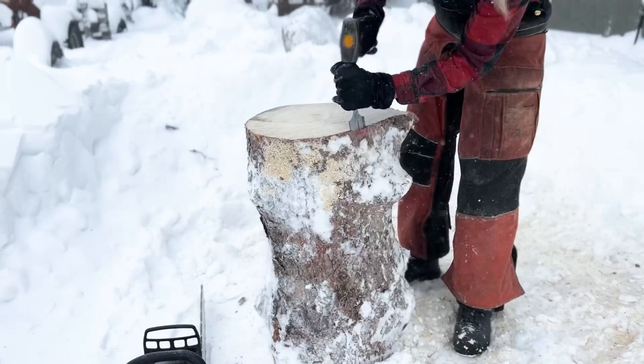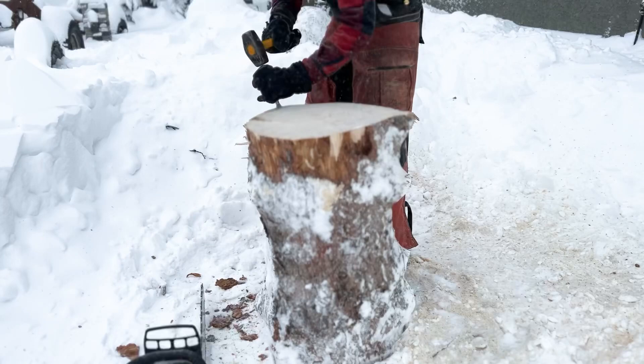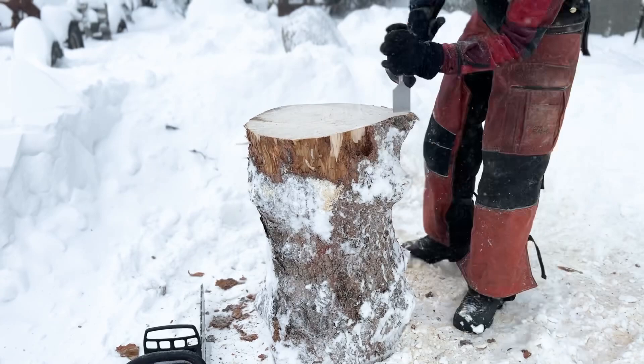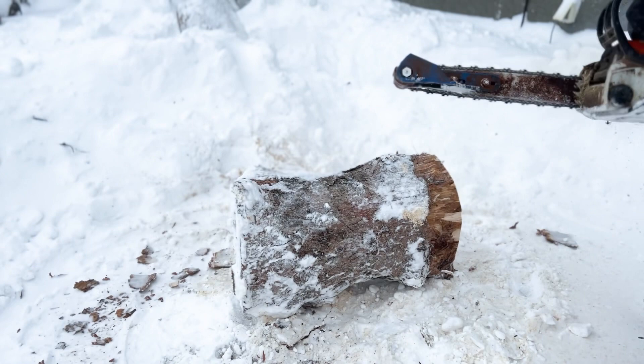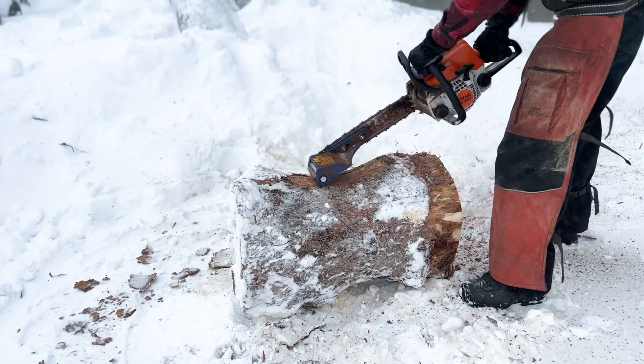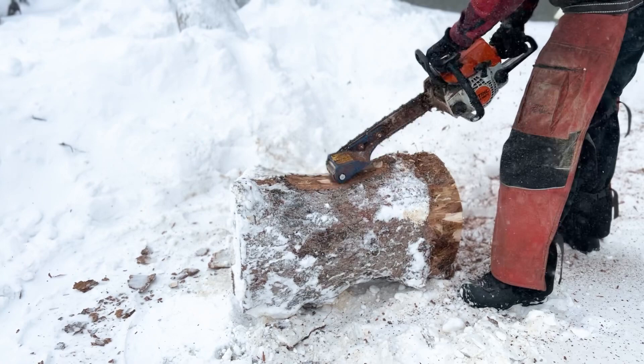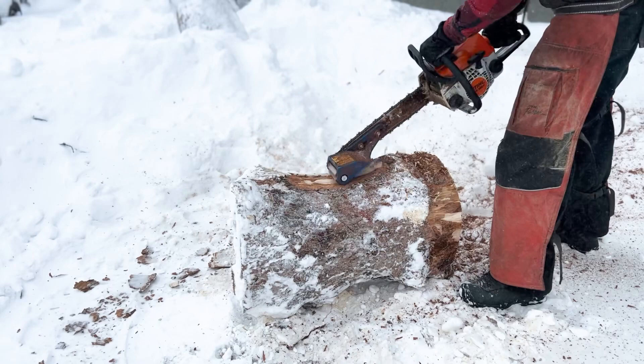Next was bark removal. Removing the bark prevents bugs and moisture from being trapped within the log. Because I planned to have a lot of the surface area exposed as a stump on the final carving, I wanted to keep as much of the natural shape and knots as possible without chewing it up with the chainsaw. Sometimes the bark is loose and peels off easily with a chisel, a draw knife, or other hand tool. This particular log had pretty stubborn bark, so I switched to the Log Wizard — a chainsaw attachment made for debarking, attached to my Stihl MS180. It works with chain-driven rotating planar blades, a super specialized tool, but when you've got stubborn bark it saves a lot of effort.